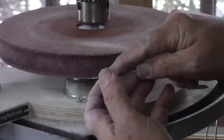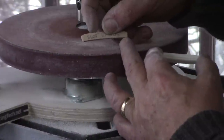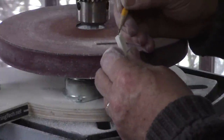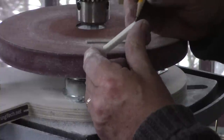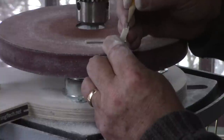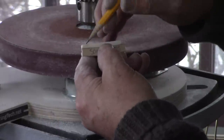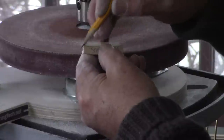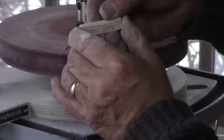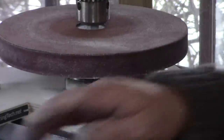We're going to switch gears. I'm going to cut the radius on the leg that goes into the slot in the fingerboard. That is my template for the slot radius. As you know, with Fenders, it does not go in very deep, so I'm just marking on each side, staying a little bit proud of what I think the final depth is going to be. I'm scoring that radius. I'm getting ready to cut. Kind of flip it 180 just to rule out any possible human error on my part. Good. All right. Next step.